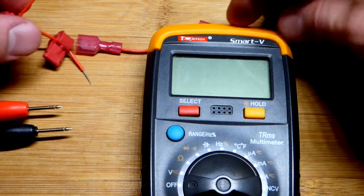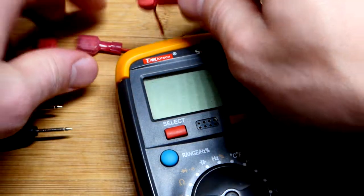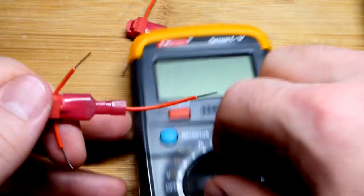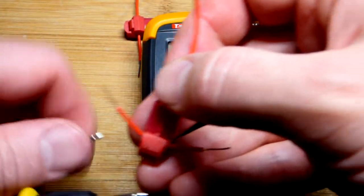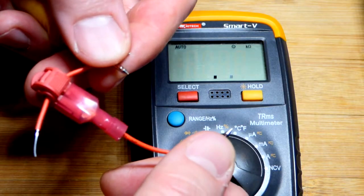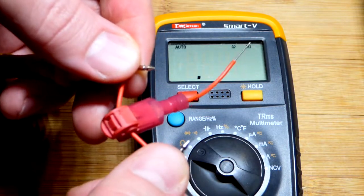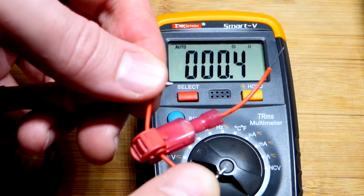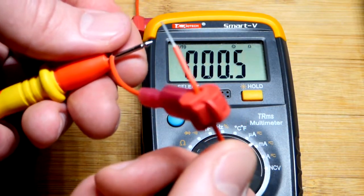Let's check the resistance. I've got the multimeter there and will plug this back in. This has the shorter wire that's kind of curved — I think that's the new one we just did. We'll test out the resistance between those two points: about 0.5 ohms, though it kind of depends on how you hold it. Looks like I had a better connection if I slid it down. Measuring in this direction too — about 0.5 ohms, then 0.4 ohms.